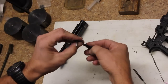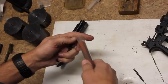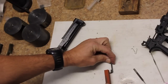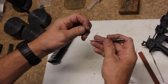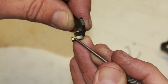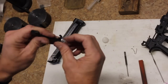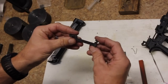To do that, I recommend using a stone. Lay that trigger bar completely flat and remove material right off the top edge. Take that stone and take that material off, trying to be nice and square. You may need to go back and polish that corner, but again, this is only a handful of guns that will run into that issue.